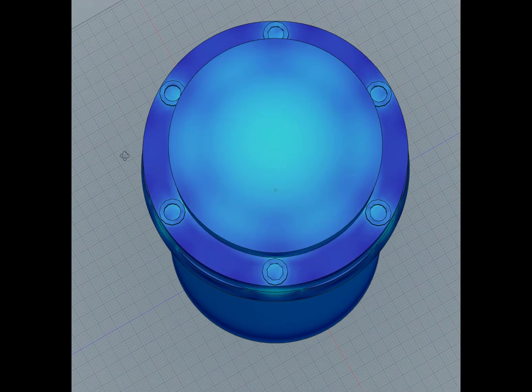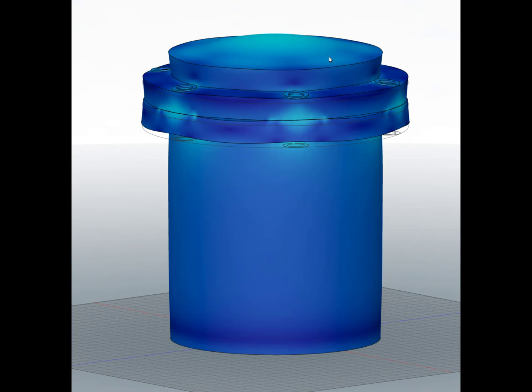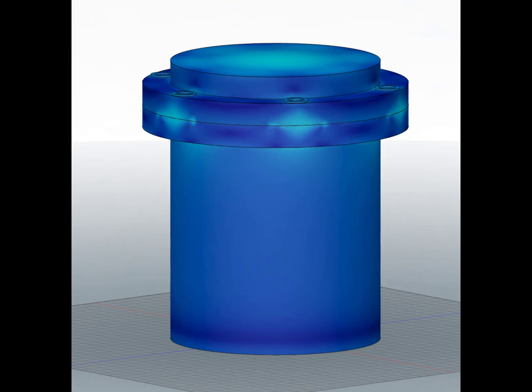In this particular case, I have six bolts holding the top cap down. I have a flat cap rather than a hemispherical one, but this gives you a really good idea of what is happening with a bolted connection. And the great thing about doing this in CAD is that we can very easily change the number of bolts. On the outside of the flange, you can see that typical frustum development in the stress field that we use as a simplification to calculate the load sharing between the bolt and the compressed member.